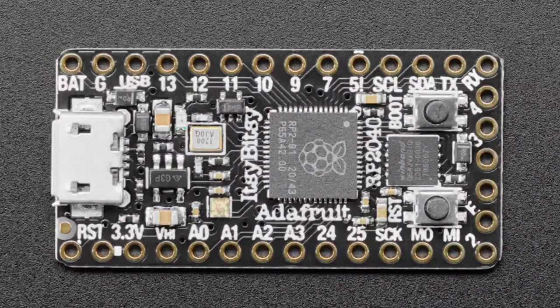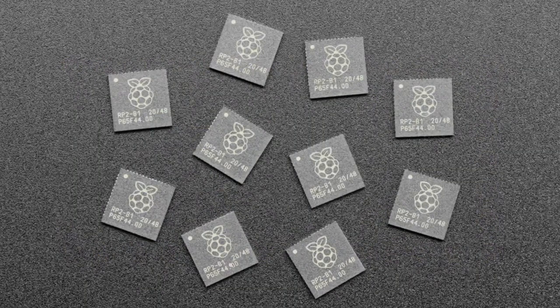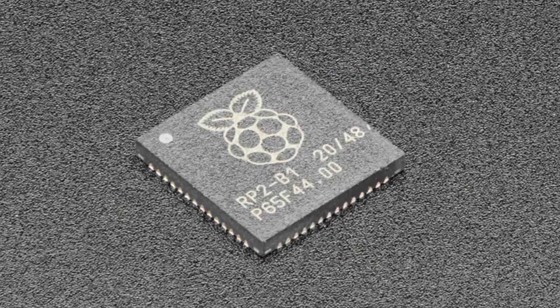It's so powerful. Dual Cortex M0 with tons of RAM. Runs MicroPython, runs CircuitPython, runs Arduino, runs Mbed. Anything that needs a lot of RAM, needs fast bitbang I/O support using the PIO clusters that are in this chip. I love it for CircuitPython because there's so much RAM, and CircuitPython requires a lot of RAM. But I've just been having fun with it, using TinyUSB to make mechanical keyboards that are reprogrammable. Yeah. The RP2040, of course, does an excellent job at it.